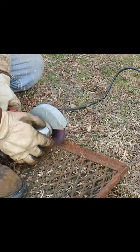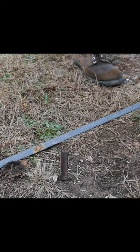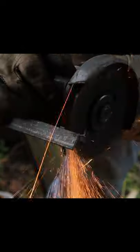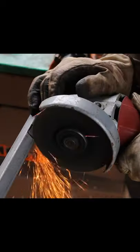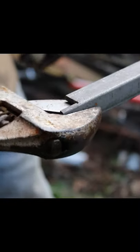I just sat there, I cut the angle out, cut off the little chunks as y'all can see. Now this is one inch angle iron. I just cut all my 45s and I cope everything out so when I fold it together it just blends right in, getting it ready for my weld. This particular angle iron was so lightweight